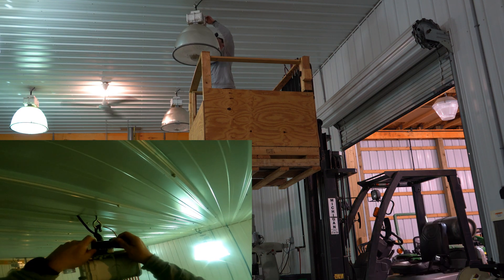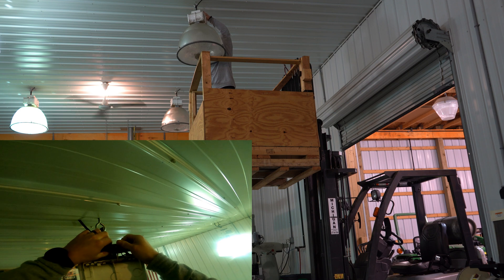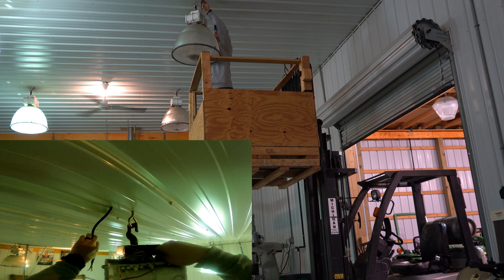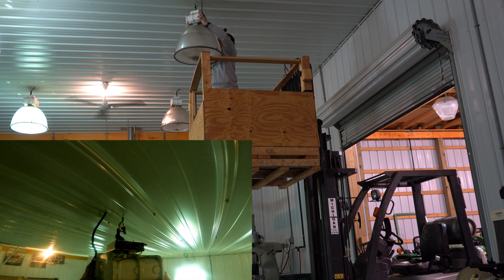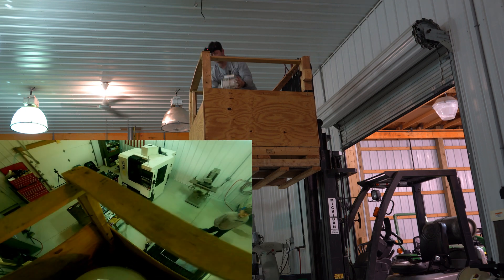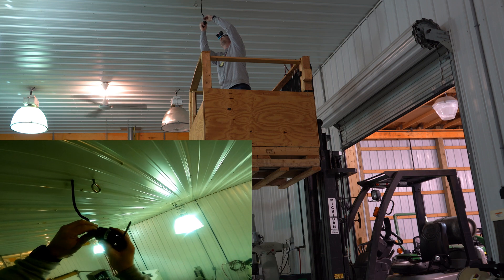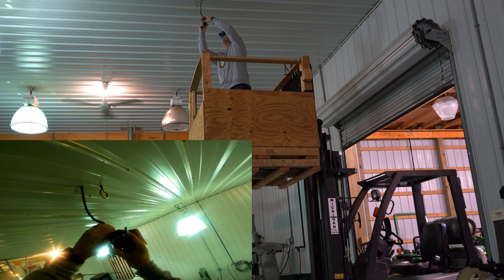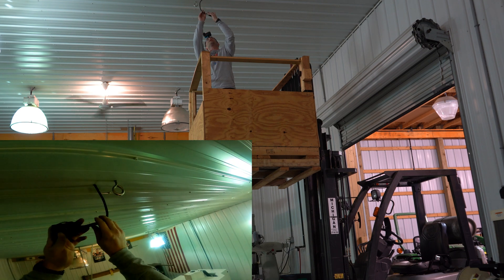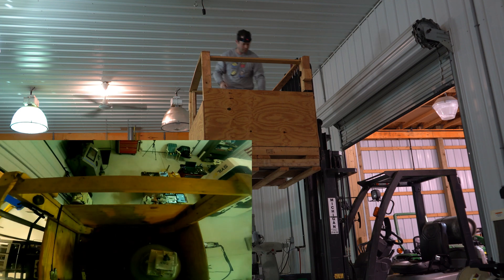I'm just disconnecting these old lights and popping them off — they're just on an eye hook as well, so it's actually pretty straightforward. Now we can lift this one off. Since this was just a straight wire, we're going to put on these little connectors to give us a 110-volt female plug that we can plug in. Now we've got the plug on it, we'll tuck it up a little higher in the ceiling, and now I can put on the LED.